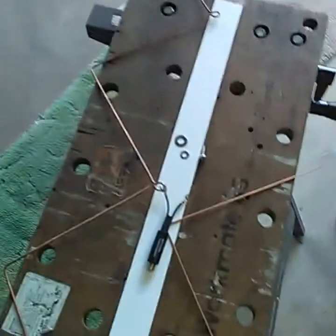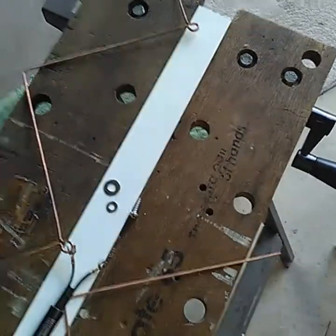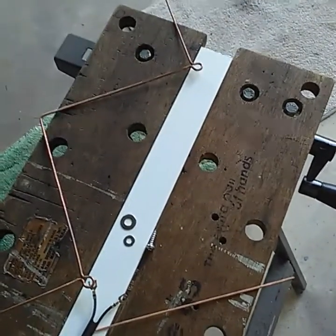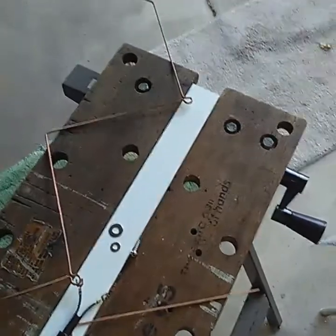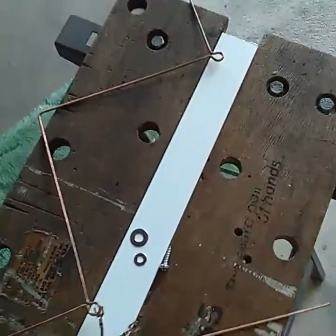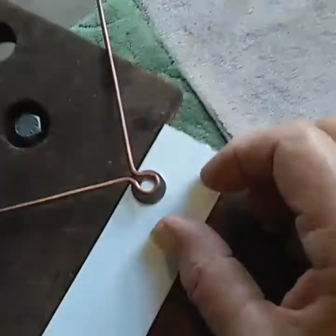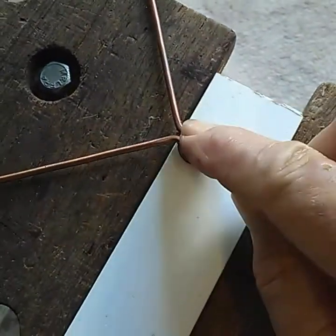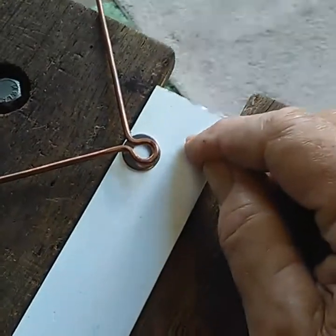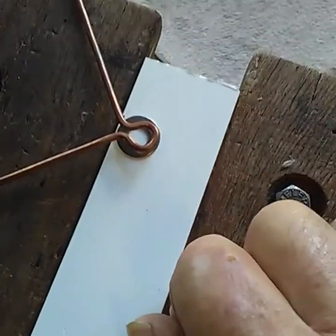Don't use an eight-foot piece of PVC — it's very bouncy and has no strength on its own. If you use a 24-inch piece, it remains pretty stable and doesn't flop around. Put a washer where you mount it to keep it from sinking in — the cellular PVC material is relatively soft.